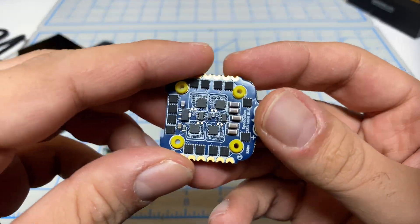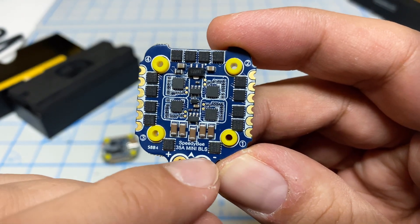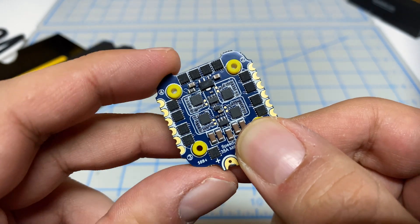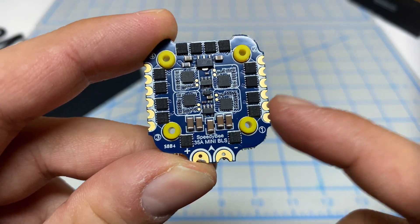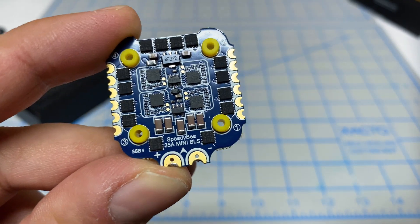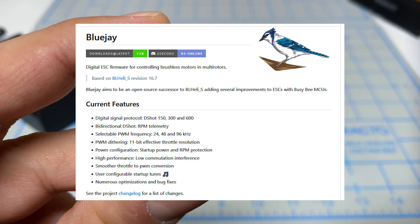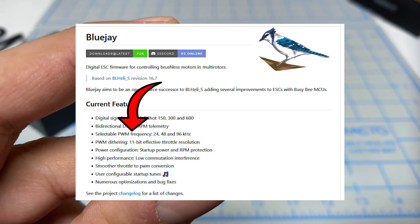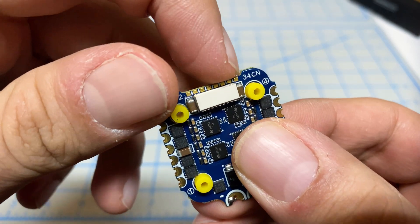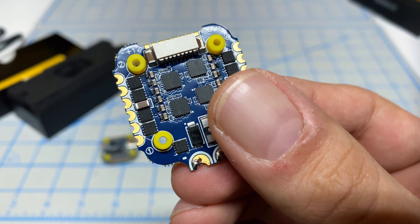Starting with the ESC, first thing I notice is I really like the color scheme — the blue and yellow works for me. I love the fact that we have holes here for the capacitor, and this cutout is supposed to allow better clearance for your camera. We have a good amount of capacitors for filtering. This has BL-Heli S, but in 2022-2023 that's less of an issue because we have a firmware called BlueJay, which gives you a lot of features that were previously only on BL-Heli 32 — things like higher or lower PWM frequency and RPM filtering. Also, there are breakout pads for the connector, so if it breaks or you want shorter or longer cables, you can solder directly to those points. That's amazing.